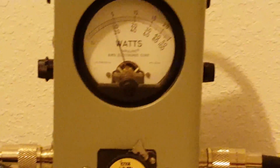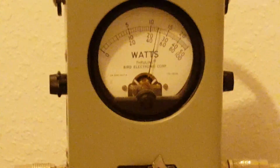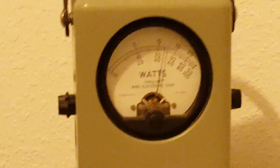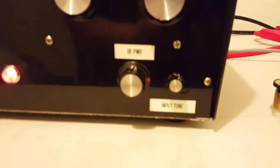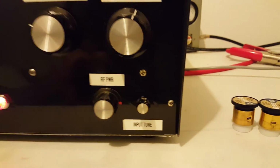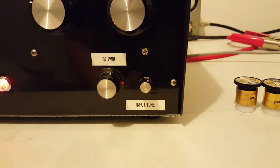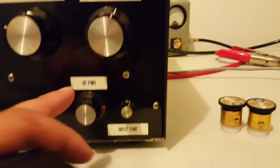Go about 200. Audio 1, 2, 3. We've been on the key the whole time. This thing ain't gonna get no trouble. Audio 1, 2, 3. About 490, 500. That's with our bias control at 3 o'clock, and we're keying almost 200 right there. Running this thing normal, if you're wanting to run the bias up, you're probably running at 150 watts or so.